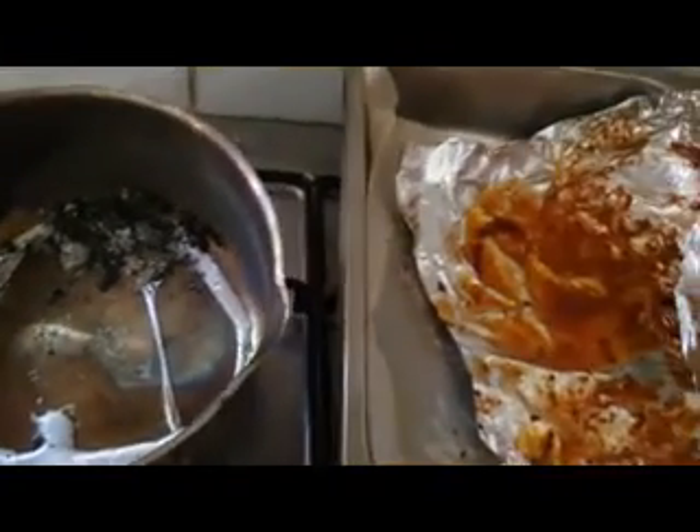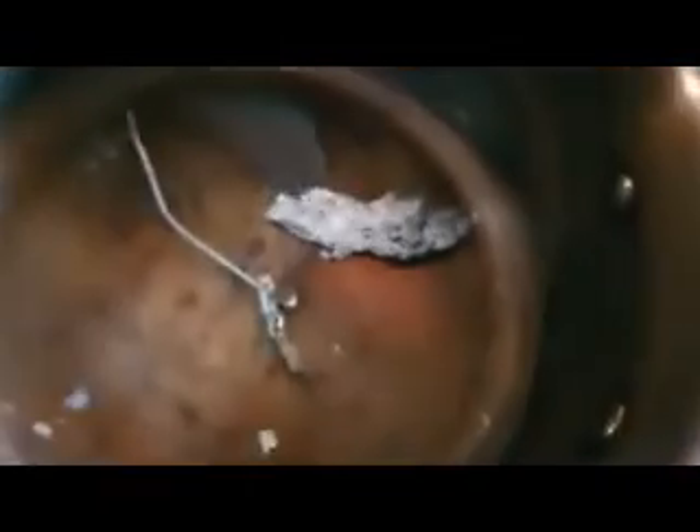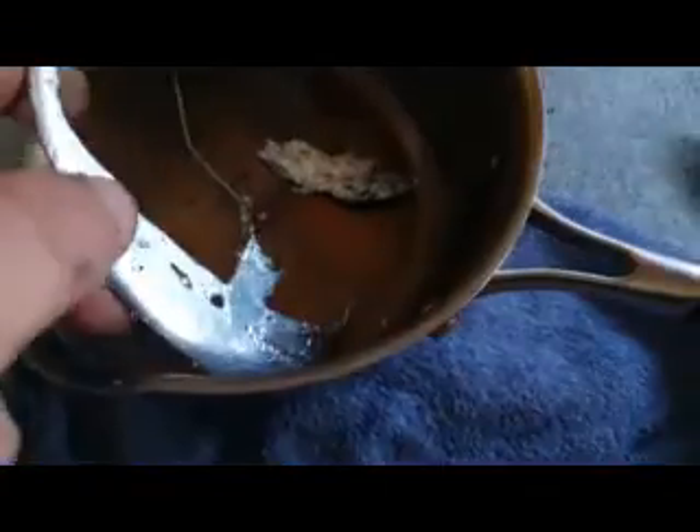Anything that can dissolve in the liquids is great - it'll help drop precious metals, and anything that doesn't will be refined out later. I'll get that out and we'll be dealing with nice clean zinc. I've picked out a lot of the rubbish now - yes there is still some zinc here, but there's bits of rubbish stuck amongst it and I don't want any of this getting in with the powder. I've got this nice big piece of zinc here and some other pieces that broke off. Now this can all go back in and get melted, then we can start making the powder.